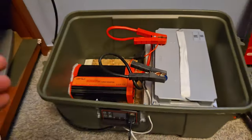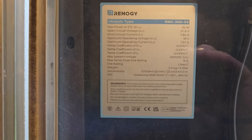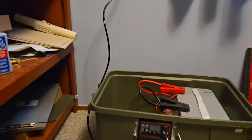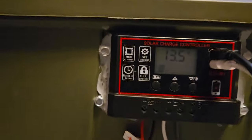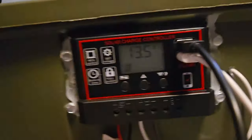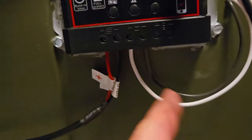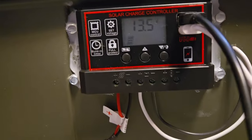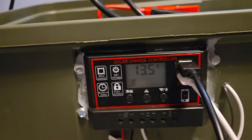Just like any solar system, as everyone probably basically already knows, we have the solar panel coming down — I think it's a 30 watt panel — connecting into the charge controller. You can see we're at 13.5 to 13.6 volts right now, so it's almost completely charged. The panel comes in here positive and negative, then we've got positive and negative going to the battery. On the far right we've got a connection where you can put an LED light in if you want something permanent around the area.